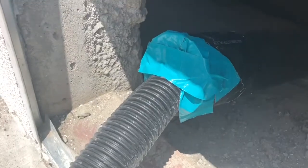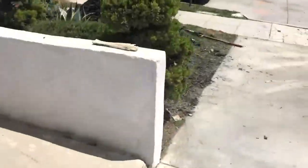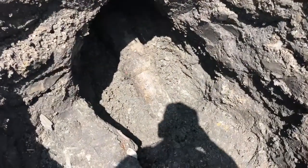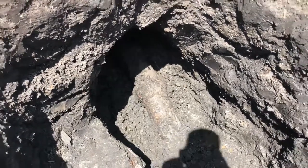So we're going to show you the next step. As you can see, we've tied the hose into the sewer clean-out in the crawl space, and that is leading us into the same direction where we have our hole. So now we're just going to sit here and wait and see if we see any smoke come out of the soil as our first test.